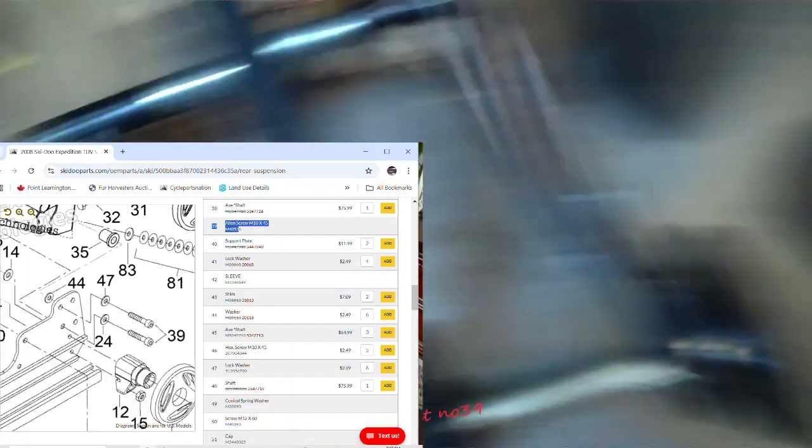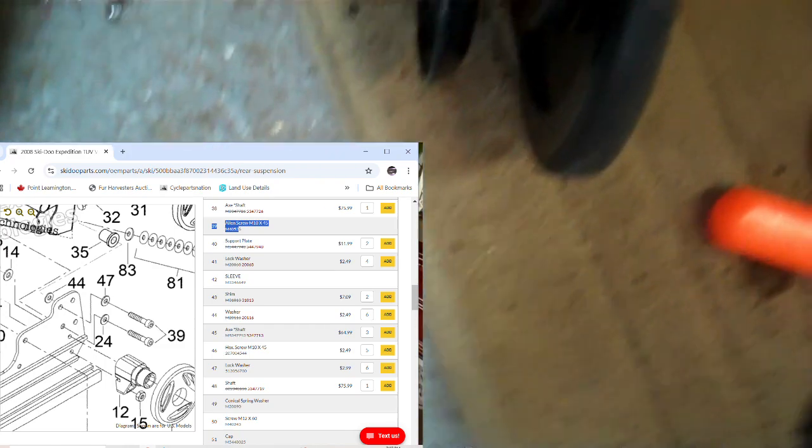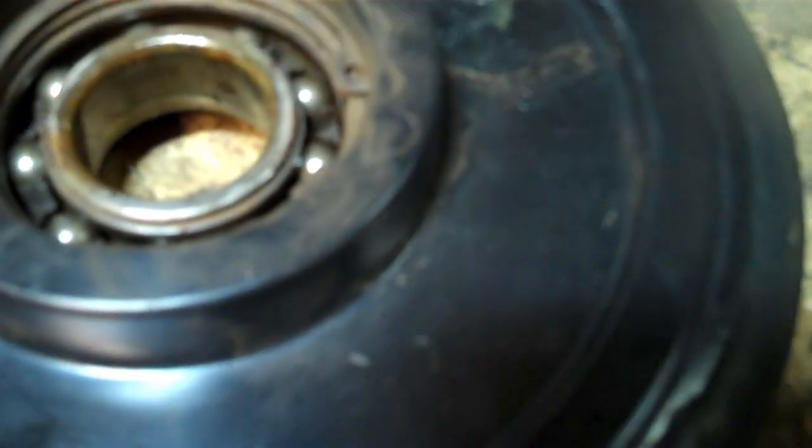On that big job, I was taking it all apart. I saw this down here, right down there. It looks like the seal for the bearing is off. I'd say he's gone probably. That seal, bearing seal right there. Looks like he's probably gone. Yep. Anyway, there's all the stuff I got off the Skidoo, and I see this bearing right here is gone, so I'm going to need a new bearing there now, and I don't know if I got one around, but anyway, as you can see, totally gone, so it needs a circlip remover.